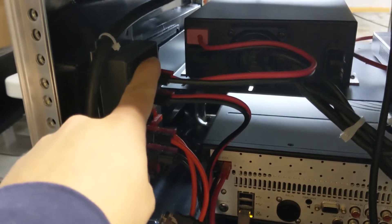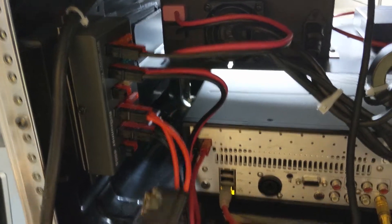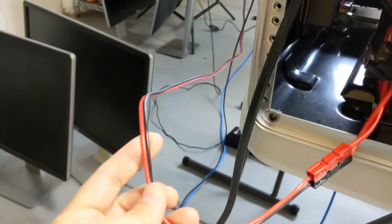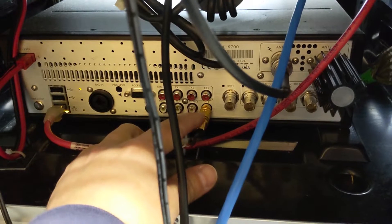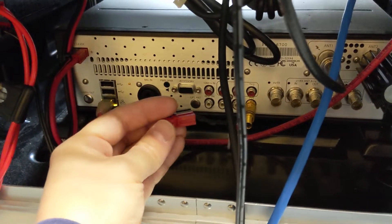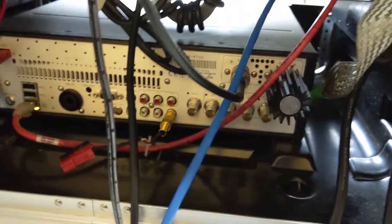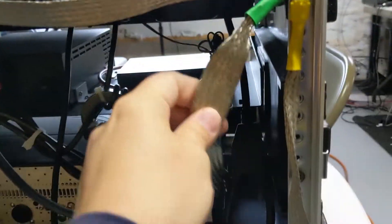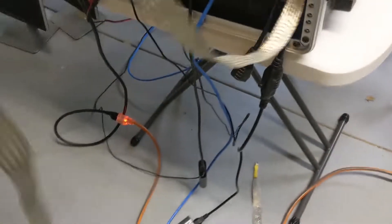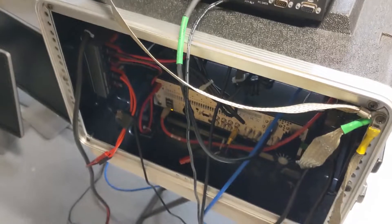So there's a power strip, power supply, Flex Radio, Maestro, and antenna tuner. This cable goes out to the Maestro. There's a PTT switch on the back but I'm not using it because I'm getting my PTT from the Maestro. I've got a dummy load so I don't transmit on antenna two. And then I've got some grounding straps — this one goes to the antenna tuner, this one goes to the Flex, and this long strap goes outside the tent and gets connected to a ground rod.